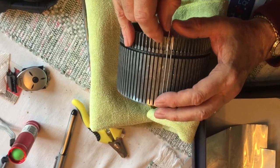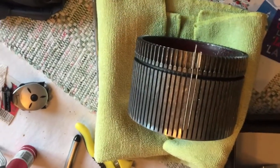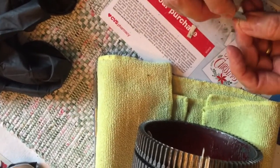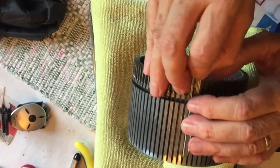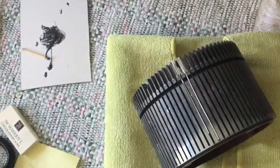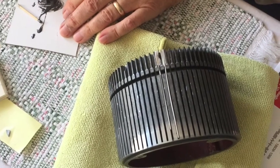We also cut out pieces of vinyl from an old plastic bottle and created strips. You can see we created two long strips that go down the entire length of the cylinder, and then smaller pieces that we insert in the wider section surrounding the broken chipped-off fin. We found that this plastic vinyl from an old moisturizer bottle doesn't stick to either the epoxy or the JB Weld Steel Stick putty, so it came in very useful. The two longer strips and smaller pieces in each slot create a small opening that supports both the chip-glue repair and the putty refabrication.